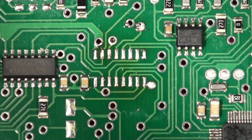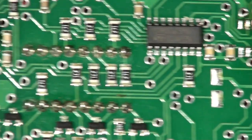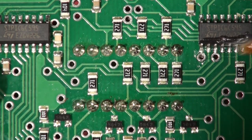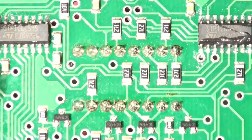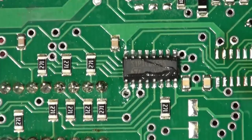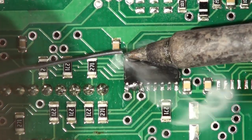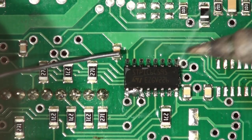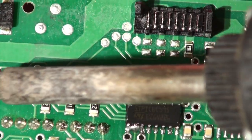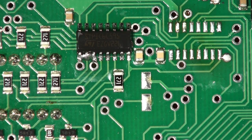That's how you do it with the soldering iron — now I'll show you with the hot air gun. Contact on the blower, some solder blob on it. If you're hot air flowing, it's easier if you put a little bit of leaded solder on just to make a tin-lead alloy, otherwise you'll have to get it quite a bit hotter to melt the pure tin solder on RoHS lead-free boards. Run some down the pins on both of them and wait for the hot air gun to warm up — we've got 336 degrees indicated.